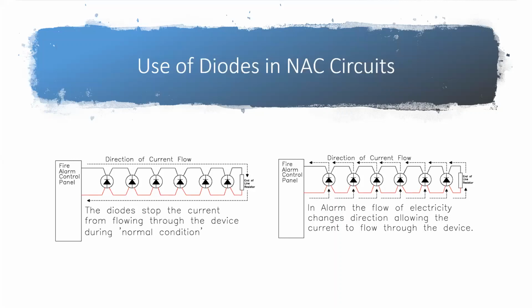That's another reason I leave that headroom in. So I leave headroom in those circuits in two ways to try to help out with things like that. One, when I start, I don't assume the voltage coming out of the panel is a full 24 or 27 volts. I actually start by assuming it's closer to 20 volts even. So we've already lost a few volts just with the starting of my calculation there. And the other thing I do is I never try to bring the circuit anywhere near that 16 volt minimum. I try to leave you a volt and a half, or 2 volts left, so that if you do have to add some extra wire to go that extra distance, the circuit should still work without overloading.